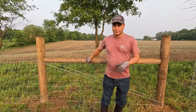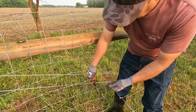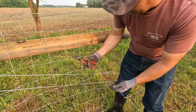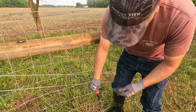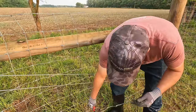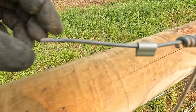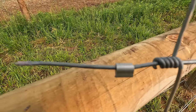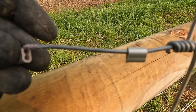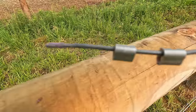I'm going to go ahead and start splicing this fence. I'll cut this off so I've got a full four inches of wire sticking out to be able to splice. I'm just going to use high tensile crimps to splice it. The manufacturer suggests using three of these crimps when you do a splice, so we'll go ahead and slide three on each one of these wires.